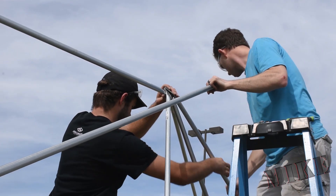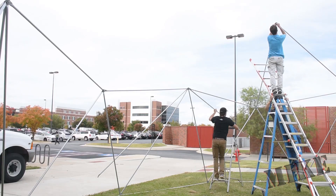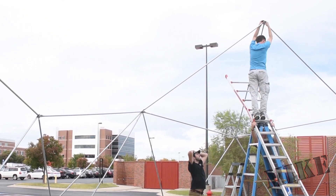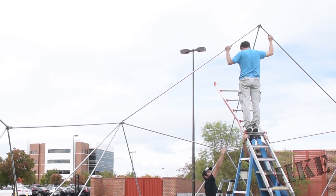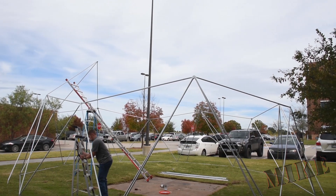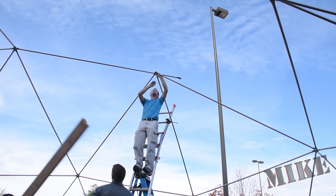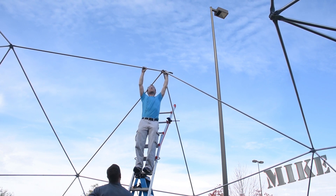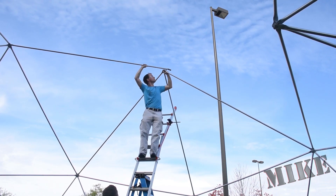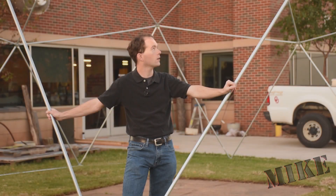I set that end on the vice grip on each side to keep them positioned, because the tubes can't directly overlap — the bolts aren't long enough — so they have to go in between. To assemble this row and higher we had to get creative with our ladders. You really should have a cherry picker or scissor lift, but we actually came up with a really clever solution for a future assembly that I'll show you later. We had to notch a couple poles. Brian served as my ladder counterweight while Cade handed me the pieces, and the dome is still pliable enough to get the holes to line up fairly easily. It was still a little unnerving but physics said I was going to be just fine — though you still should have a cherry picker.